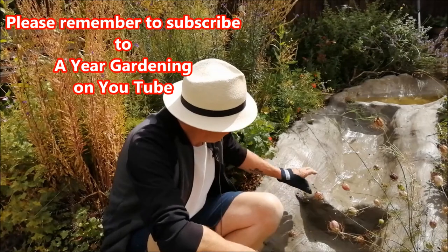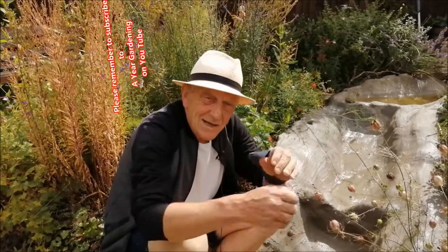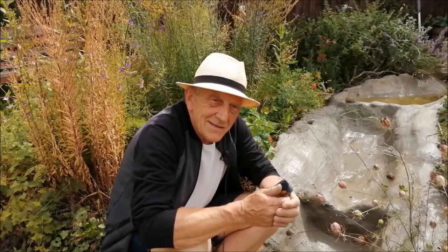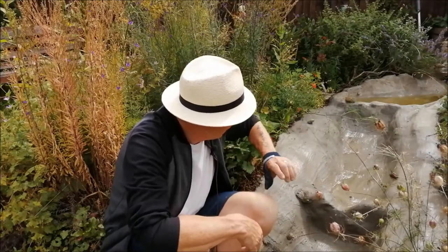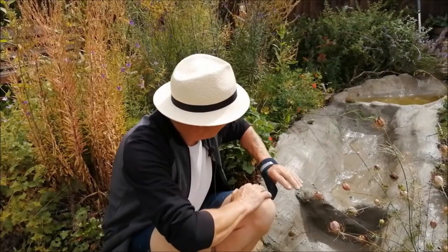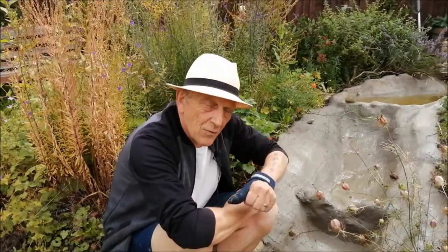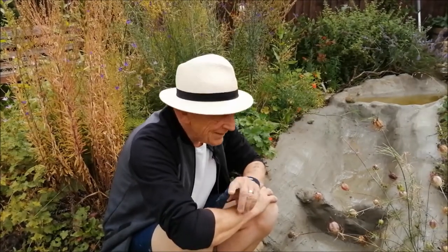I've got all the materials now. I'm putting a 15mm cement-based render — a one-to-one mix of sand and cement: one part cement, half a part builder's sand, and half a part sharp sand, forming the base. That is mixed with an animal-friendly waterproofing agent. Once the cement mixture is dry, I'm also covering it with another waterproofing agent and a frost proofer so it doesn't get affected by cold weather. I'll run you through some of the progress on this later in the show.